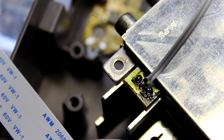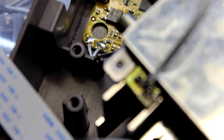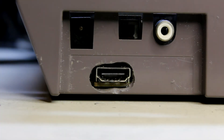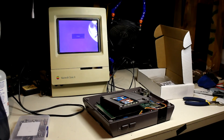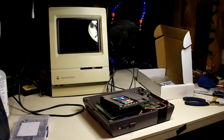Now we're going to give the HDMI board power by soldering it up to the voltage regulator on the RF module — just solder it to the plus and minus in the top left corner of the board. I dremeled out the opening and then 3D-printed a plate so I didn't have to bother with precision dremeling. Now you can fire up a test and as you can see on that small HDMI LED panel in the back, it is working. We're ready to reassemble it and give it the final go.